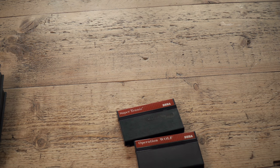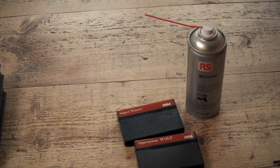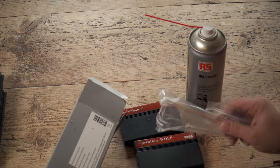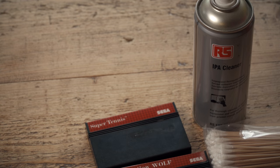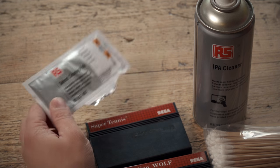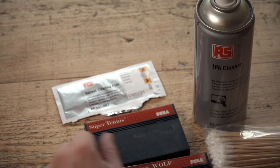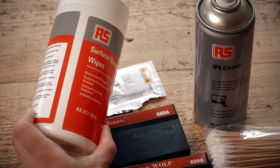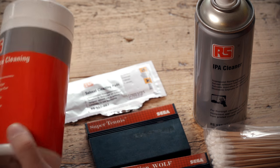So this is what you need. You will need some IPA cleaner — that's isopropyl alcohol. You'll also need something to wipe the cartridge with; these are specialist cotton buds from RS. The ones out of your partner's makeup bag are not sufficient. You may also need some solvent cleaning wipes — these are essentially isopropyl alcohol on specialist wipes. These can be handy; you don't necessarily need these, but if you're doing a full clean-up job you might. And finally, just handy to have some basic surface cleaning wipes — these are standard cleaning wipes used for screens and things. Not essential, but can be useful in certain circumstances.